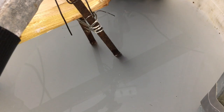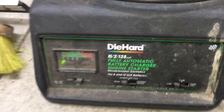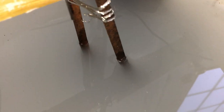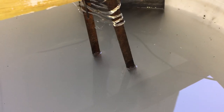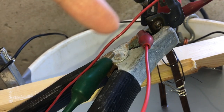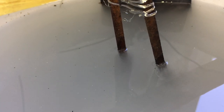It's been almost an hour and I've only had very tiny bubbles coming up, so I went over and figured I'd try switching the charger to manual — and now look at those bubbles! Manual made all the difference, so don't try the automatic setting. I wasn't getting as many bubbles off the far one in the back, so I got some alligator clips connected to the negative clamp running them over to the farther back wiper, and that seems to have gotten the bubble level closer to being even.